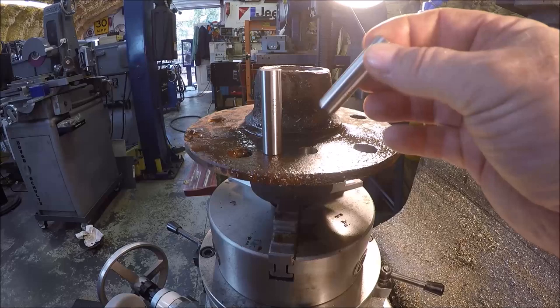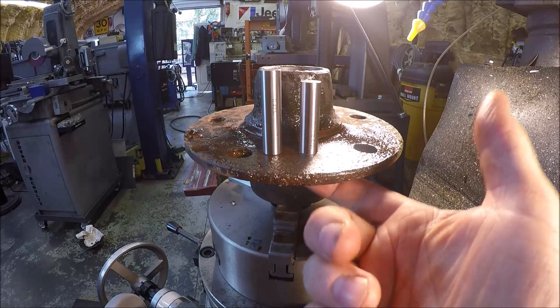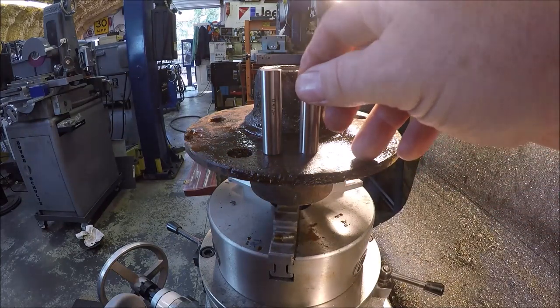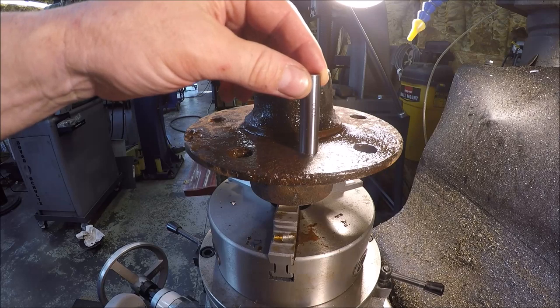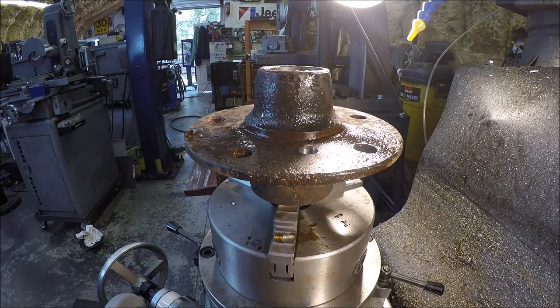So this is a 472 gauge pin, and she'll go in. Obviously there's a burr down the bottom, so it's not allowing it to go all the way through the hole. And of course I can't get to it once I pull the hubs out, and I'll deburr the bottom hole there. This is 473. It wants to start, so that's good. We're about close to the nominal size that he needed, so this will work good. But the drill bit did obviously drill the hole larger by almost 4 thou, so 2 thou in one direction. Let me rotate around, get set up, and we'll do another hole.